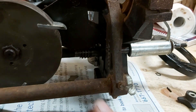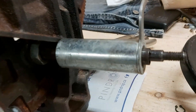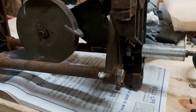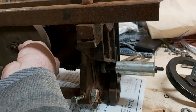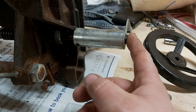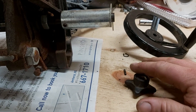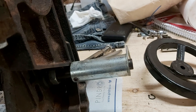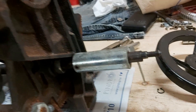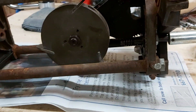There's a snap ring on here. Originally the sleeve, this washer, and this snap ring holds that washer, and then this pin is just so the handle can grip the shaft. As you turn your handle, the screw raises the head. The washer holds the head and the screw on the head so that when you screw it in it raises the head. If you take off the snap ring and the pin, the shaft moves freely — that's how you make your table saw a plunge cut. You basically just push in on this pin and the head will go up.